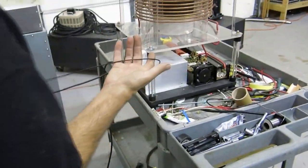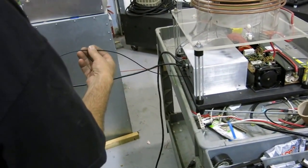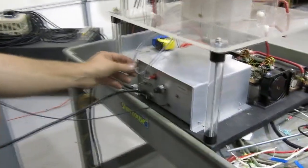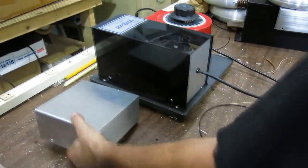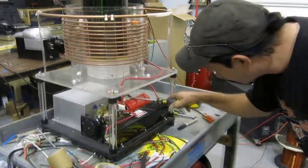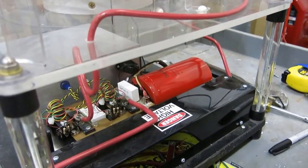I got some better quality opto cable, and I got you a fiber optic — it's glass, a light pipe. It's got a lot less attenuation. You wanted six feet, I got you a little bit more than six feet. Just notice that the red goes to the red — it's pretty obvious where the connections go. Those should be connected when you get it. The only thing you'll have to do is connect this opto cable into this box here — I may just leave it connected. The only connection you'll need to make is the cable: red to red, ground side of the rail, positive side of the rail from the variac and the power supply.